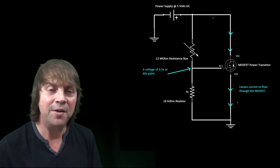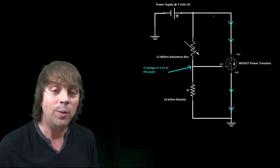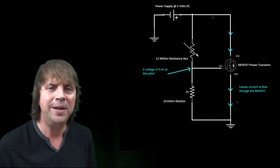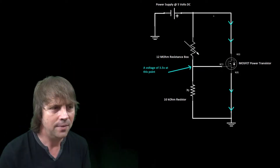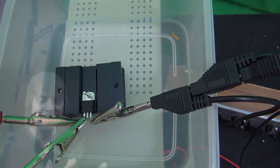Bench power supplies have a very low output impedance or internal resistance, so we're going to need to draw a significant amount of current from the power supply in order to be able to test its output impedance. This type of MOSFET transistor can in theory conduct between 20 and 30 amps, but to do that you need to mount it on a heatsink — and that's what I've done. You'll see we've put on a heatsink, and that heatsink is immersed in water, but not the MOSFET transistor itself.